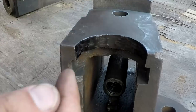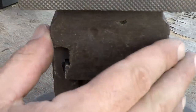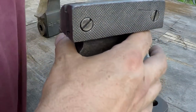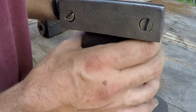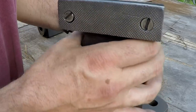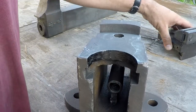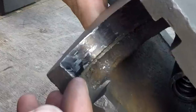So I've marked up the inside of this here with a little bit of Sharpie. I fit this guy in there, get it in the right spot, work it past that rough spot a few times. I've been working at this already a little bit so it'll actually slip through there pretty good now — still a little tight though. Can you see the light spots right here? That's where it's rubbing.